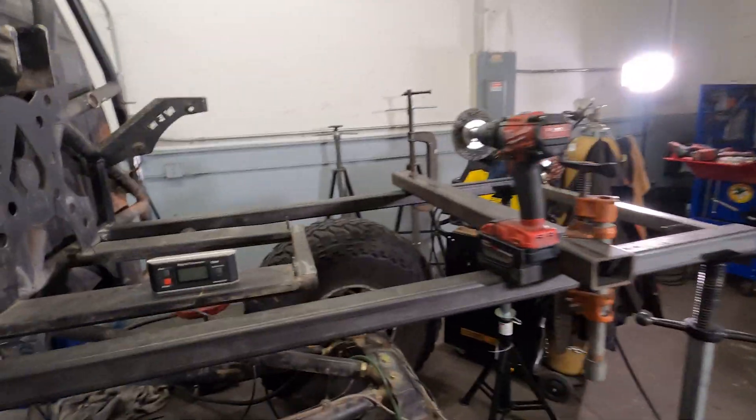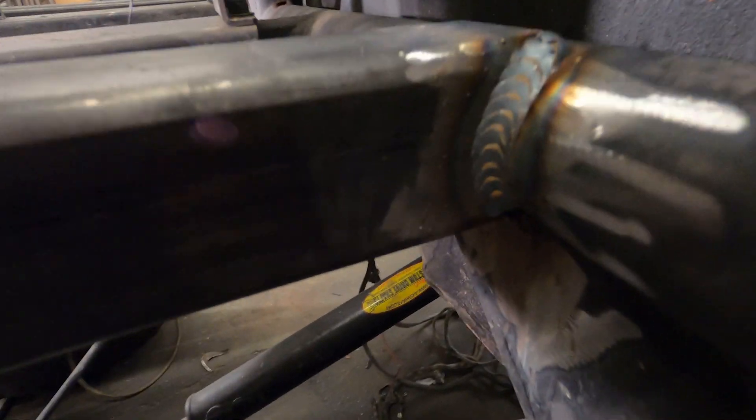Now that I've decided this is level, I went through and did a couple of welds — but I did a big no-no here. Do you see all that porosity? It was really porous from that tack weld. I can tell now: it's the 3-in-1 oil I use when I'm notching, and instead of cleaning it off I just burned it. It even came out a little on the other side too. As the oil seeps out and heats up it gets into the weld, so even though a weld might look fine, I'll grind that out and redo it.